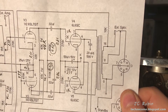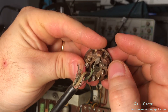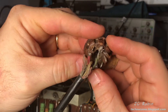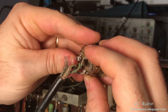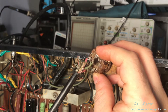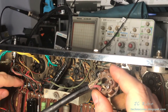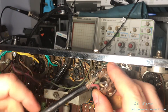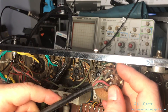The diagram says pins one, five, seven, and three, with a short to seven and three. Let's try this - I got one, two, three, four, five, six, seven. So I got one, five, six, and seven - that doesn't sound right. There should be nothing on six. So this is wrong according to the multimeter, and just by looking at it visually, this black wire coming off the standby switch is going to the red wire.